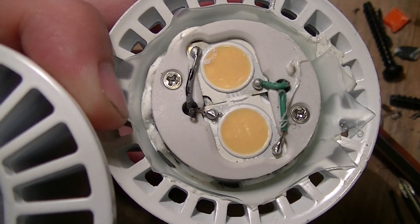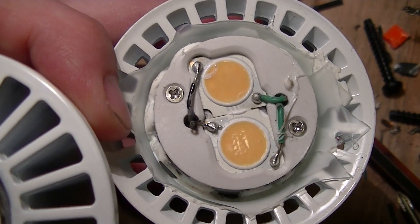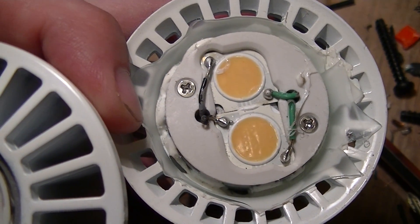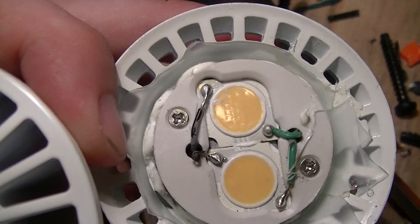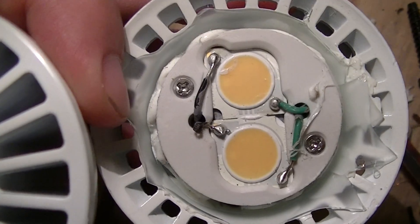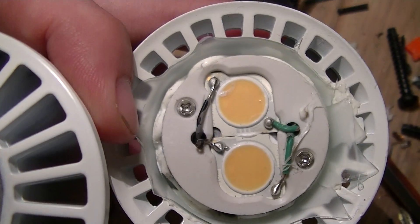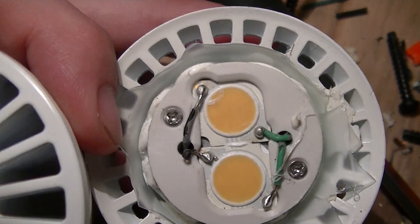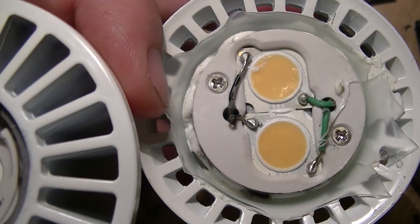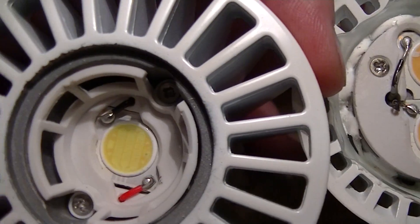This one is 5400 Rankine — I think it could be 4860 Rankine, I don't remember really. The way that white LEDs like this work is that to get warmer color temperatures they use more of the cerium-doped yttrium aluminum garnet phosphor, which is the yellow goo that you see in white LEDs, or at least almost all white LEDs.